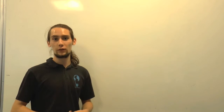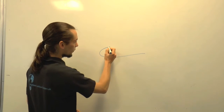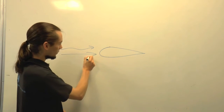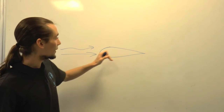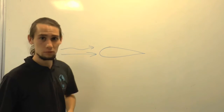There's a couple of features to this lighting system which help to minimize the effect of the lateral loads we're going to get maybe from the wind. So let's just look at them briefly. First off, we've got the shape of the profile. As the wind is going to hit this profile, it's got an aerodynamic shape, the wind is going to be channeled around, and there's going to be less force directly acting on it. So that's one feature which is quite useful.